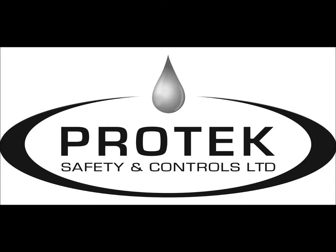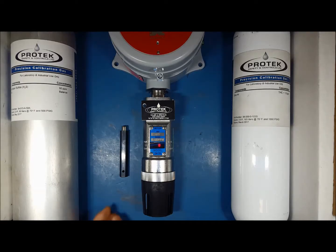In this video, we'll be showing you how to calibrate the Detcon DM700 toxic gas sensor unit. As with all calibrations, be sure that the operator knows you are going to be doing a calibration, and confirm that the unit is in bypass mode. When in calibration mode, the milliamp signal will go from a normal operating signal to a 2 milliamp signal, and may trigger a shutdown. We will start with zeroing the unit.